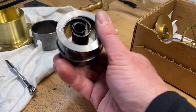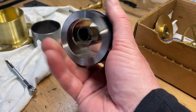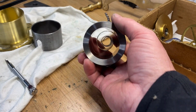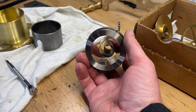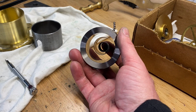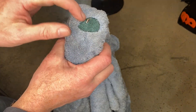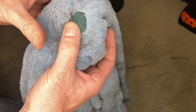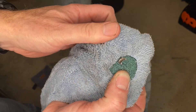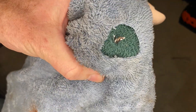This skeleton clock has a very strong mainspring — a typical mainspring for a skeleton clock might be two-thirds or half this size, so this has a lot of power in it. We're going to treat this with a lot of respect and take it slow. What I do is put the spring underneath some old towels with holes cut in them to expose the wire, then put on protective gear, cut the wire, and it should unravel under the safety of the towel to absorb all the energy.